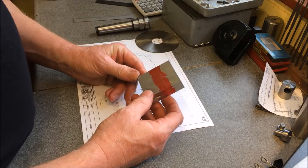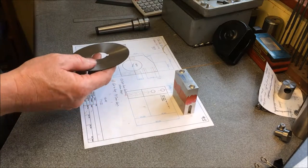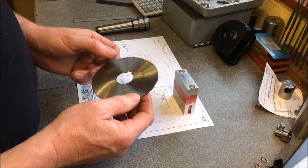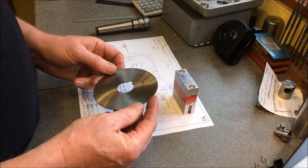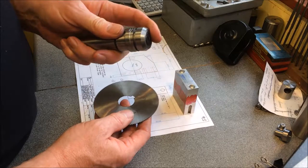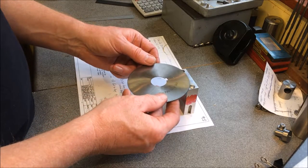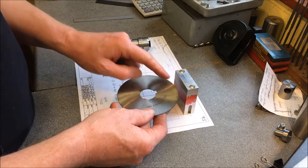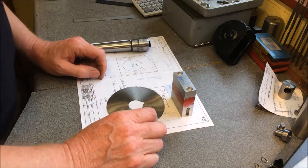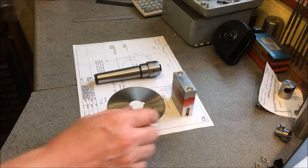I'll set that up on the mill in the vice in the vertical position. I've been into my box of bits and found a slitting saw which is a four inch diameter but 0.8mm thick — quite why they didn't say it was 100mm diameter, not sure. I've got a three morse taper slitting saw holder, and what I shall do is set that up in the mill, touch off on the top to start with, then move down to the right depth and take the cut across to split the block. I need to get the arbor and slitting saw put together, and once I've got that done I'll bring you back in.